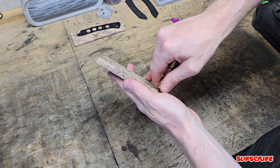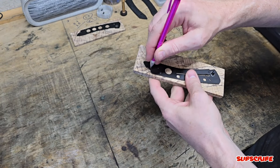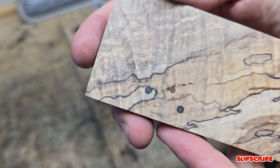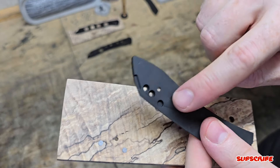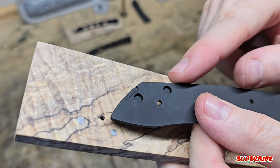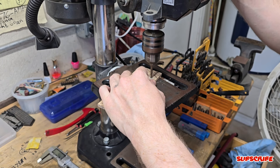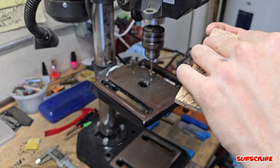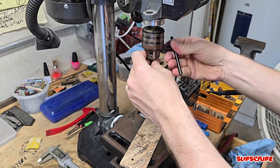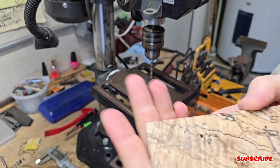Here I'm tightening down the screws into the liner and making sure everything lines up, which it does. Now I'm marking the body screw holes where I'll be countersinking for those body screws, allowing them to sit into the new material. Looking at the old one, I'm basically copying just that. I chose a slightly smaller drill bit to locate the center of those holes, then switched to a slightly larger size to enlarge them, allowing enough room for those body screws to fit into.